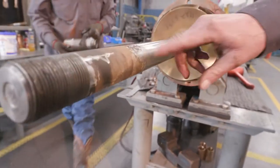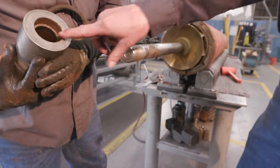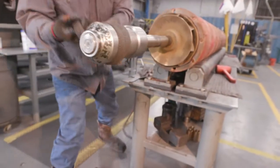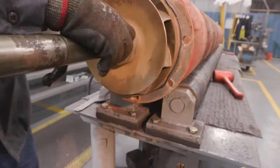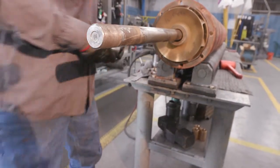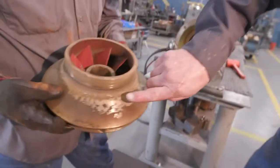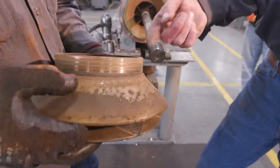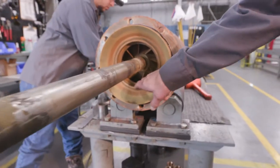This is the kind of wear we're looking for. We'll use this end of the collet knocker to tear down the pump, knock the taper lock out of the impeller, and remove the collet, then move to the impeller. Now we're looking for any damage on the impeller skirt. As you can see, there is wear from foreign material being pumped through the bowl unit and in the bowl skirt.